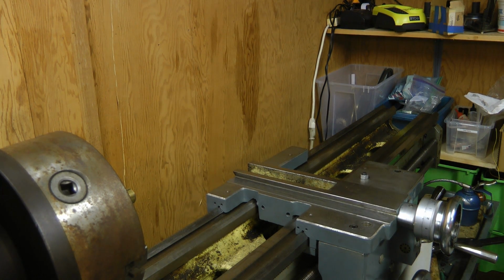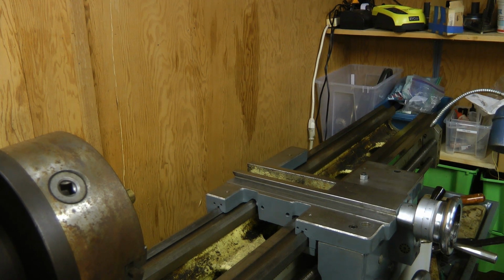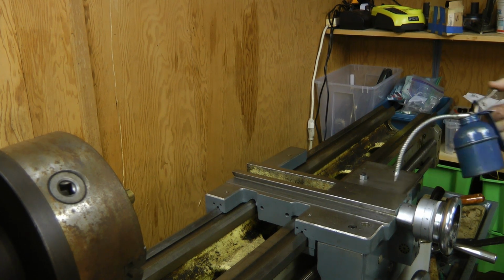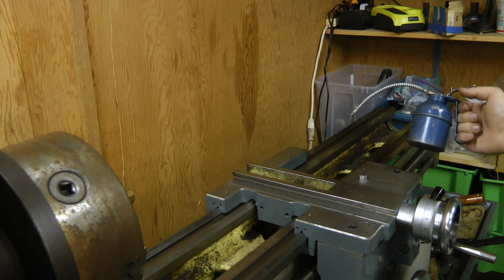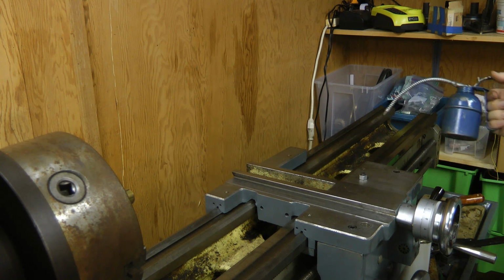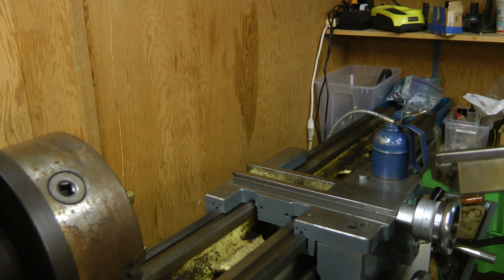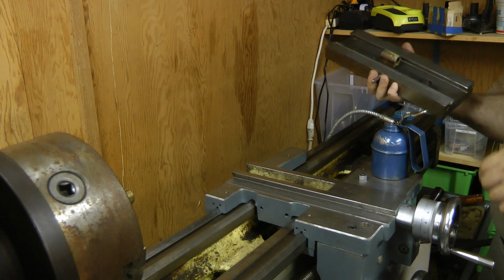Cross slide back on. The oil I've been using is ISO 68. That's what the manual from the Grizzly lathe said to use for most of the things. It also said to use it for the ways. I've seen this ISO 68 labeled as sort of a universal lubricant, like for gears, machine tool oil, way oil, so it seems reasonable. The stuff I used previously was, I think, lithium grease or something. I've just taken that off, so we'll go with this. Well, I've left that grease on the lead screws.